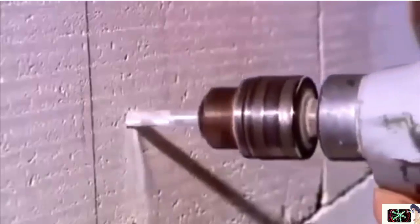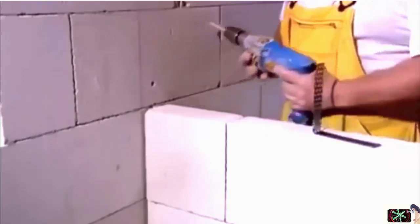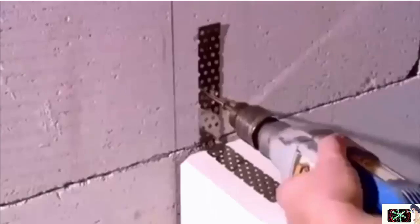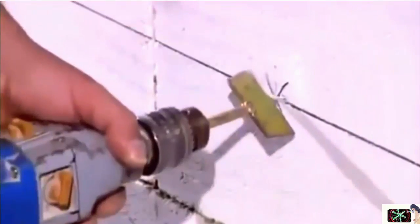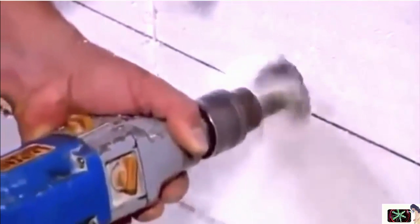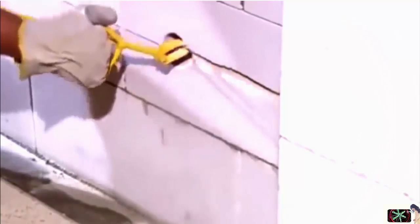Partitions, especially in the attic, can be anchored in a slightly different way. Fix a connector into the masonry with an anchor for aerated concrete. Do not glue the partitions to the load-bearing walls. The finishing touches are very quick and easy. With simple tools, you can make the openings and grooves you need. Walling with Itong blocks is very efficient — the shape of the house is visible within 14 days.